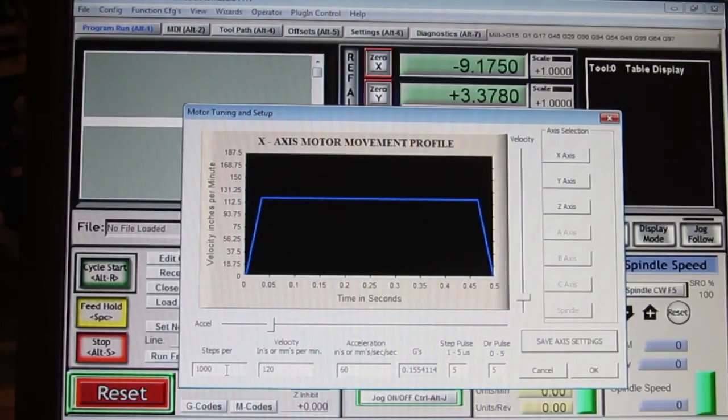it's 1.8 degrees per revolution, 1.8 degrees. Well, I forget. Anyway, you can calculate it out. If you've got all that information, you got the ball screw and how much distance it travels over an inch, and it's 1.8 degrees per step. With that information, you can figure it out. Trust me. Mach 3 will do it for you, however. Thank God.